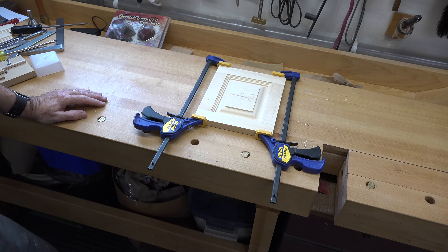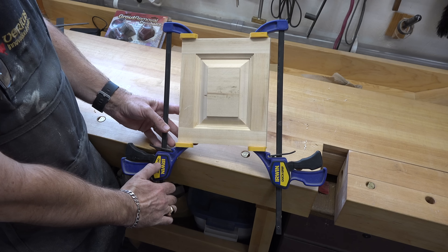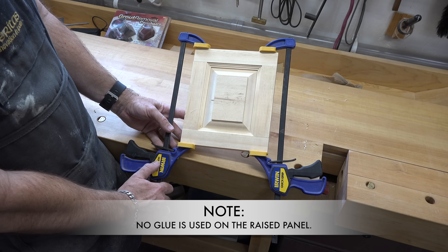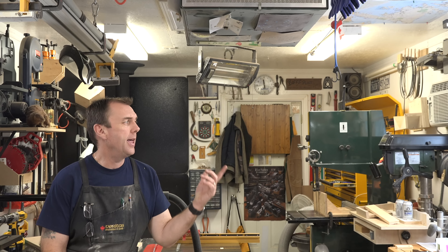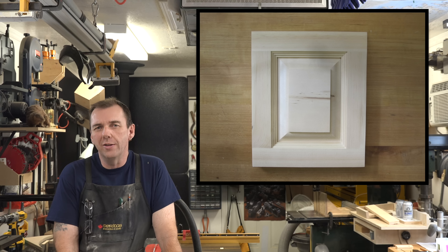You can see that it looks pretty spectacular. We're going to glue it together — put glue on all interior surfaces. I'll come back and see you when that's all done, give it a little sanding. And there you have it — a raised panel door using rail and stile joinery.